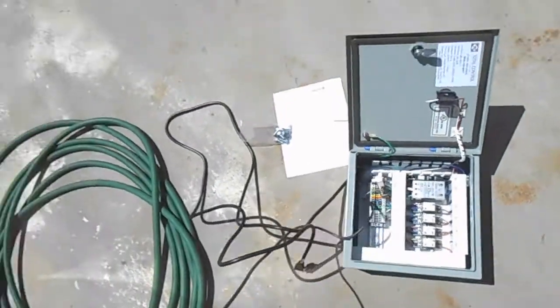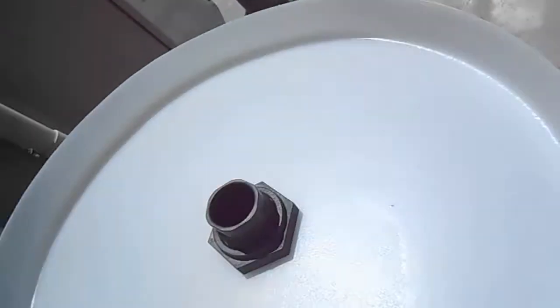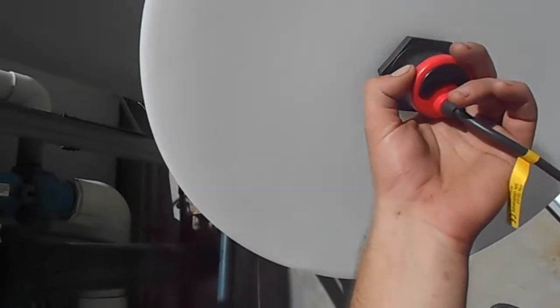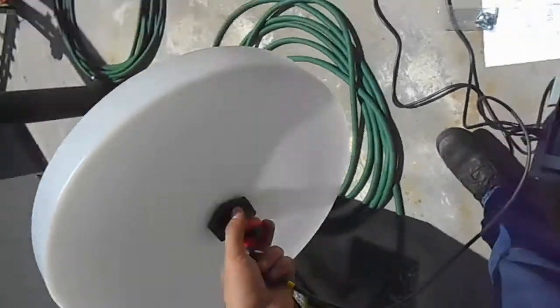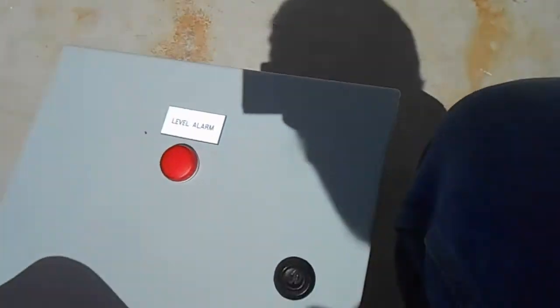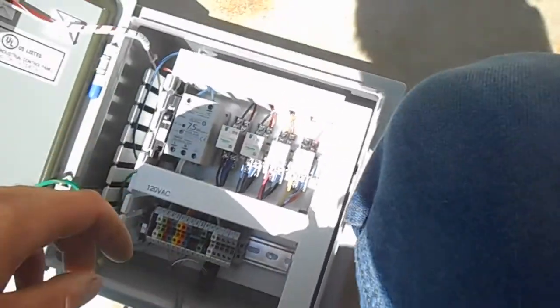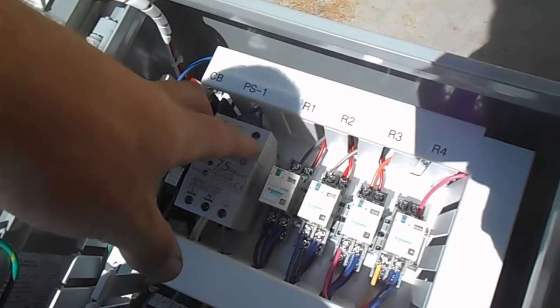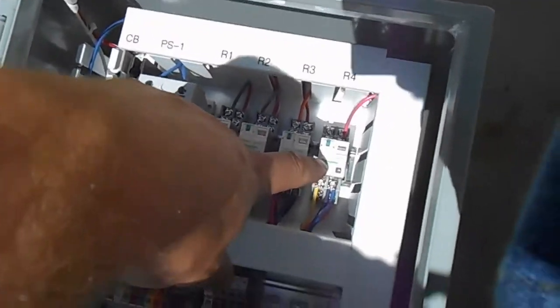Over here is the lid for that tank. This is an electric level sensor with no moving parts. And the brain of it is not sitting inside the cooling tower where it's part of a harsh environment. So we put that lid on top of the ground. And what do we have here? A shiny new control panel from our friends at RSD. Probably about the most basic panel you could get. But it's got low-level and high-level relays in there. And this is powered by DC voltage — we take our 120 volts in and then we have 24-volt direct current output. So these are 24-volt DC relays.